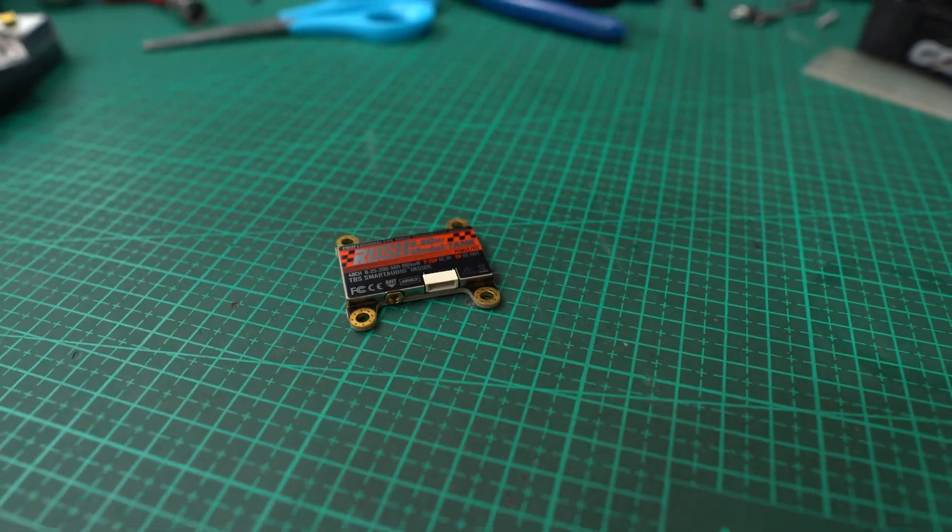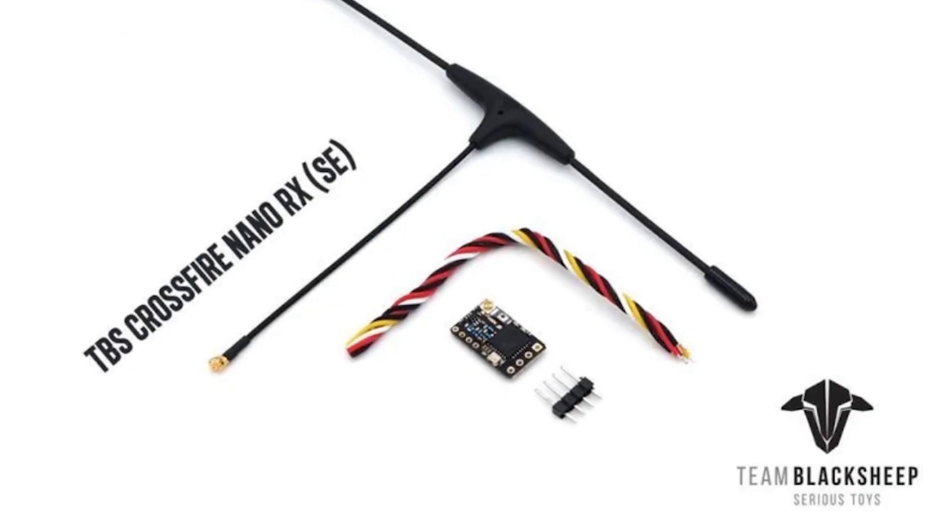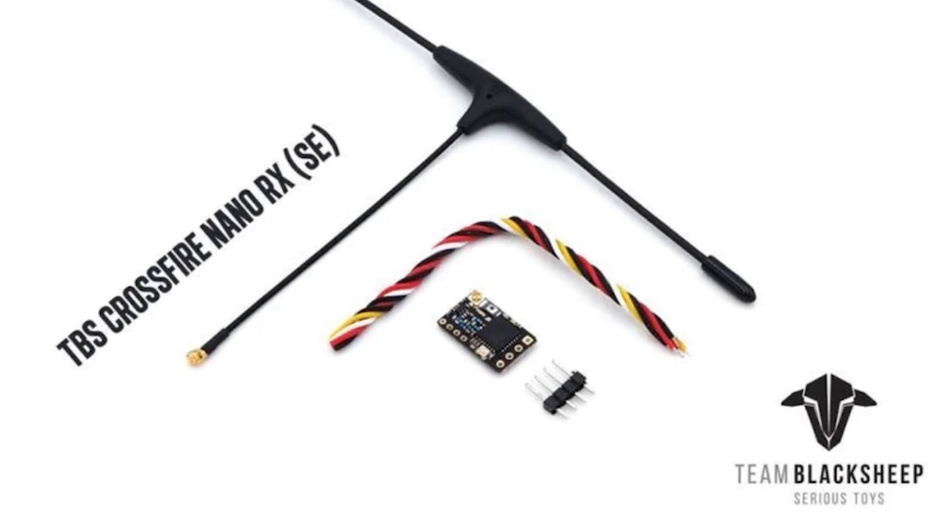For those still flying analog, something like the Rush FPV with a metal casing on top — during the drying process remove that metal casing to expose the chips, run it through isopropyl alcohol and contact cleaner. In my experience, whenever an analog VTX goes underwater it never performs well afterwards, so it's better to just buy a new one. For receivers: I fly Crossfire and ExpressLRS in my fleet. Crossfires are quite well built and operate at the 5V pad, so short-circuiting from VBat is less likely to compromise them. Some of my Crossfires have been underwater and made it out alive.